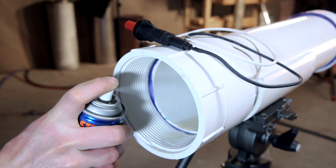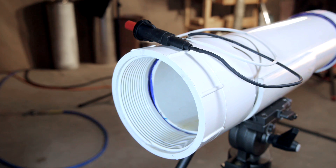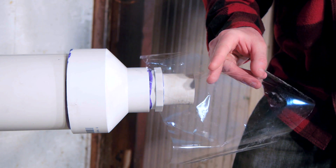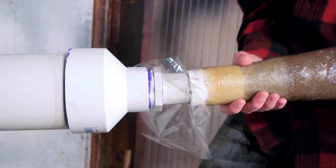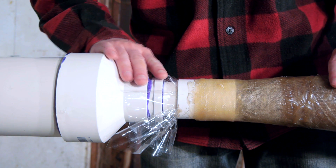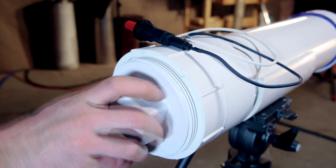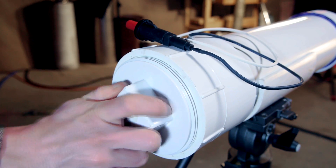The cannon is fired with flammable aerosol spray in the same way as a classic potato gun. I use a thin plastic film pressed between the barrel and the chamber to act as a burst disc for more powerful shots. A burst disc allows the combustion to reach a higher pressure before punching through and accelerating the vortex down the barrel. This can make for an impressive result.